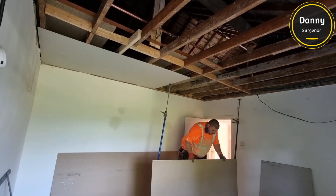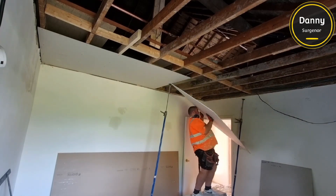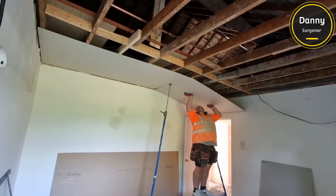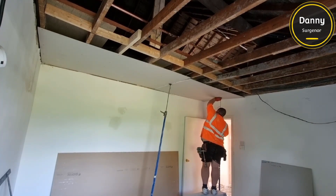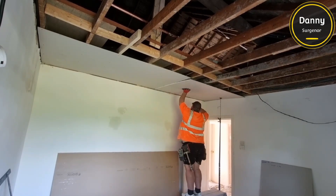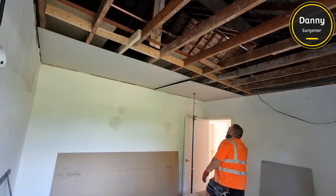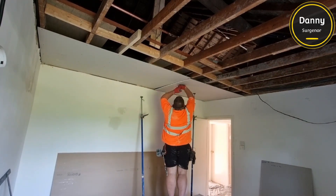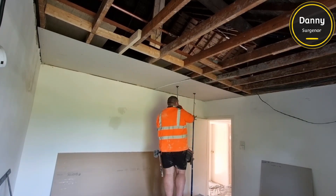You can see I've set the plasterboard prop here just half on and half off that board. I struggle a bit because it's in my way, but you'll see it slips in underneath the plasterboard prop and it actually holds it up. We'll prop one side, move it more into the middle — it actually fell down at one point, but once it's propped up you're just doing the same thing, screwing. It's pretty straightforward.